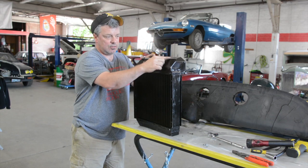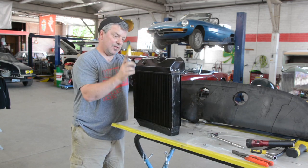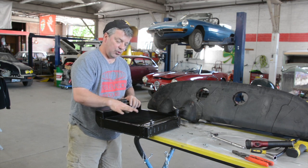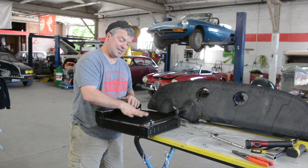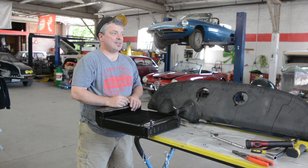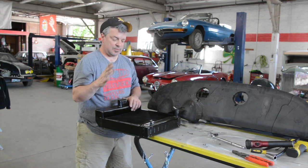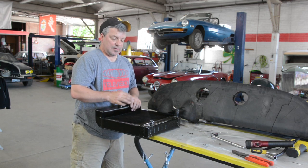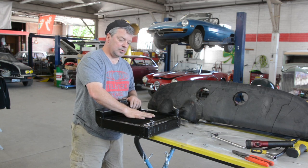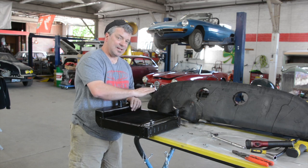If they're running bigger motors, they need higher cooling capacity, especially if they're racing high-performance motors. So what we have done is come up with a GTA exact replica. The top tank on these is a little tighter on the angles than the original, but for the most part this is dimensionally exactly like a GTA. This is made out of brass and copper — this isn't your normal everyday radiator. This thing is thick; the radiator inside is dimpled, so we have over 25% higher cooling capacity in this core. Aluminum is okay but does have its drawbacks — if it doesn't have the ability to wick the cooling capacity out, you tend to have problems keeping the car at that ideal sweet spot.